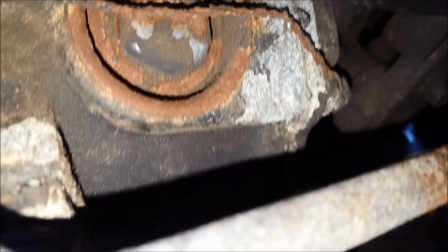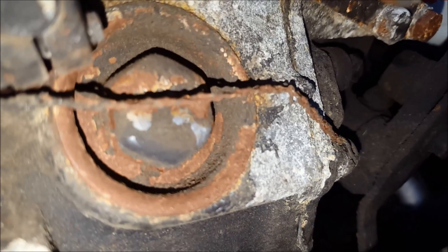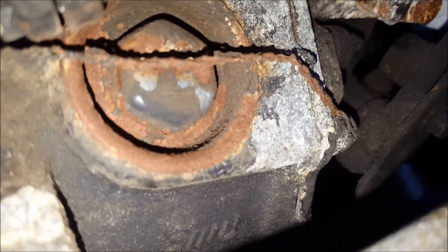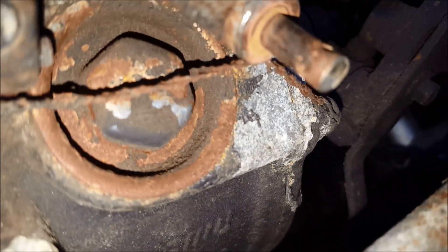Coming down in here, I've got some safety wire across my plug. I'm going to cut that safety wire out of the way. That's a 7/8th plug — or 22-millimeter — that you're going to remove down there. Make sure to clean around the surface very well before you go taking it. You're also going to have to remove this linkage — it might be in your way, so get that out of your way.